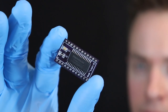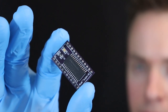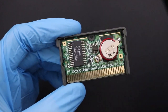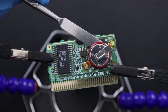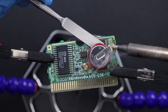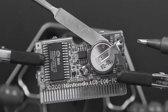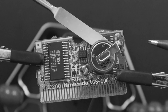This kit allows your game saves to be stored on a microchip without the need of a battery backup system. Historically, many retro game cartridges have relied upon a low-power SRAM microchip for game saves. And since SRAM is volatile memory, a coin cell battery must be used in these game carts in order to keep this data alive on the microchip. Fast forward over 20 years later now, and a lot of these batteries have begun dying, thus causing a game cart's SRAM to forever lose the game save data that was once stored on it.